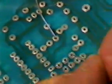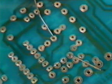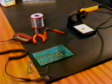When you insert component leads through the holes in a circuit board, bend them outward like this so that the component is held firmly in place. Do not insert too many components at one time in order to prevent the leads becoming cluttered. Place the board on a workbench and make sure that it cannot slide around during soldering. A mat or cloth placed under the board may help.